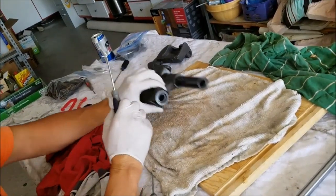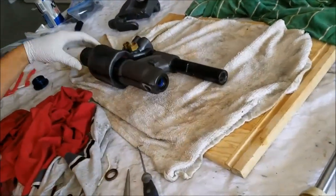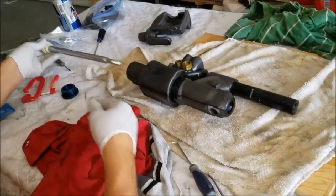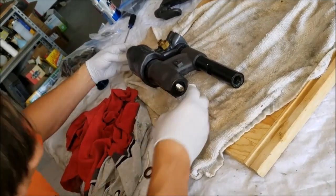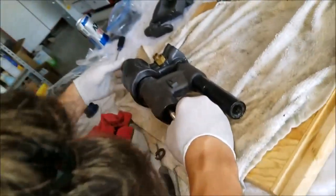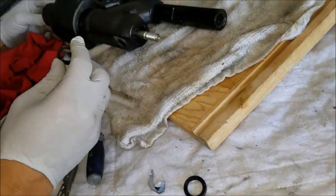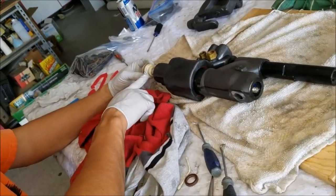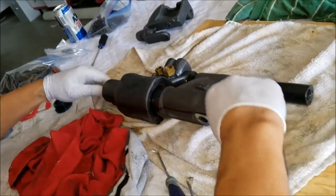This is the steering actuator for the Volvo Penta. Why are you doing this? Because it was leaking off this end. This rod goes in from this side. There's a seal in here, and it gets brittle and starts cracking, then it'll start leaking right there — so you have to replace that seal. You can see it's cracked right there. I cracked it a little bit more taking it out, but it was already riddled with cracks. I did some reading that said just leave the other cracked parts and don't mess with them.